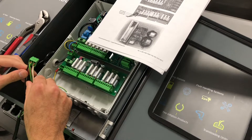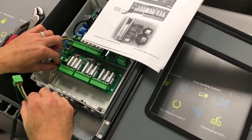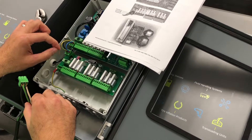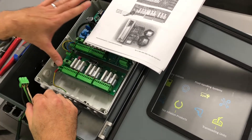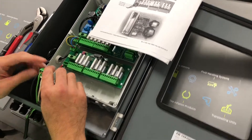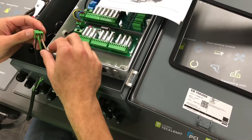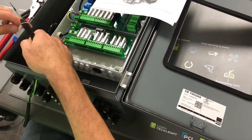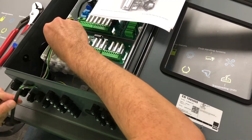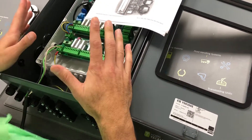In this case, if you notice the bottom left-hand side, this module here is where you're going to bring your 100% dedicated power line. Nothing else can be on that line — only clean power to bring into the actual motherboard. On the left you're going to have your hot lead, then your ground, then your neutral. The fact that I can actually take this out and make my connections here, take a flathead screwdriver and tighten this thing as I go, then go back and insert it into the module as such — and I'm done. Makes it a lot easier to wire this.